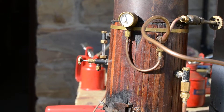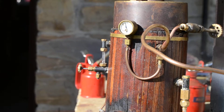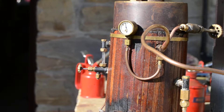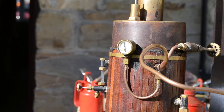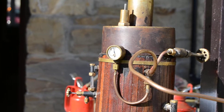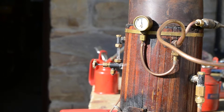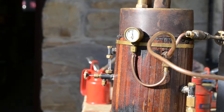If you notice, on that very short blast of only a couple of minutes the water gauge is virtually at the bottom now — it's quite thirsty at high speed. The pressure is now climbing; it's probably up to 40 pounds and will be at 60 in a few seconds. So we're building back up the pressure, but it's drunk a lot of water doing that. Let's top it up with water now — you should be able to hear the engine slow down a little with the cold water in the boiler, and the pressure should drop but the water gauge should climb.